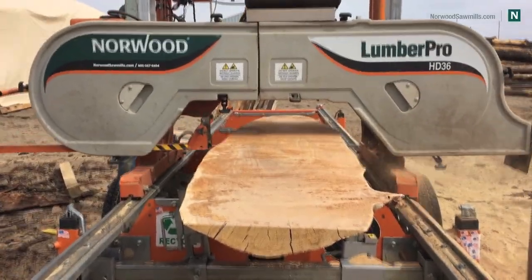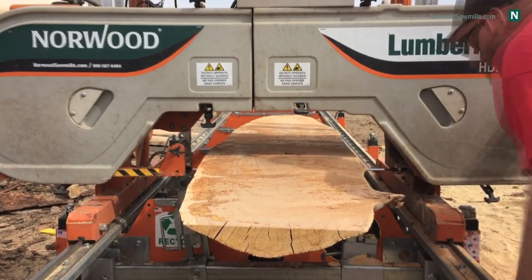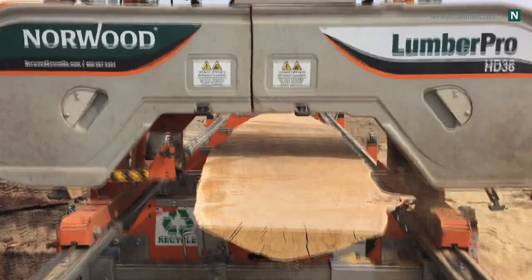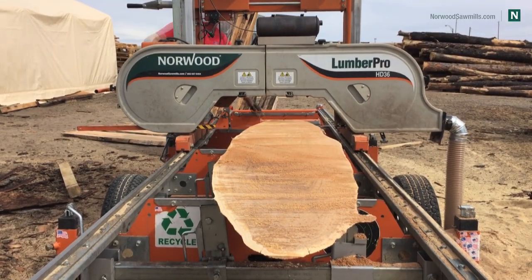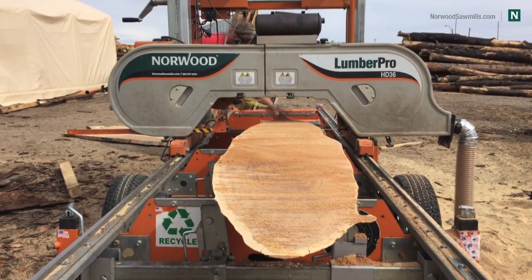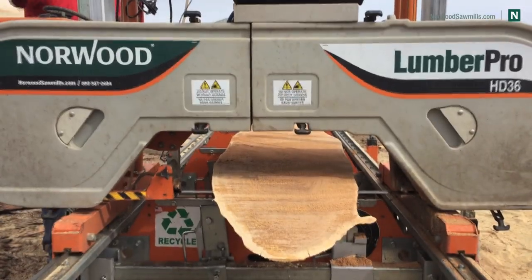As you can see, I hit my dog right there — you've got to pay attention to those dogs. I had it set a little bit higher because of the weight, and I should have stopped and lowered it as I cut a lot of that weight out, but I forgot about it. So that was my bad — at least I wasted a blade, but it's totally worth it.